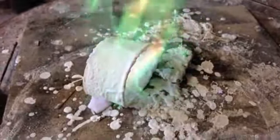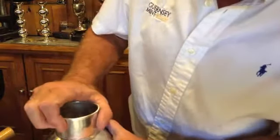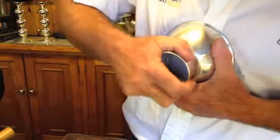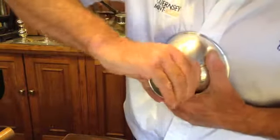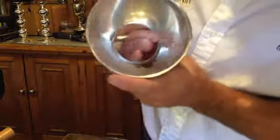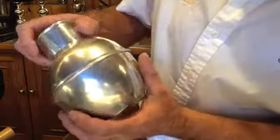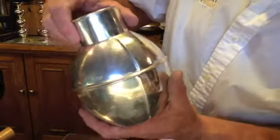Just let that bubble away for a minute and then have a nice white flux over it. I can then get the high temperature and silver solder straight down that middle joint. What I'm going to do now is take the milk can apart and then this neck here I'm going to screw in — you can probably just see as I work like this, as I turn it around and screw the neck right into the can. So here we are like that — I'll tap that up to get a really snug fit. That will then be soldered in and I'll solder in the other half at the same time.